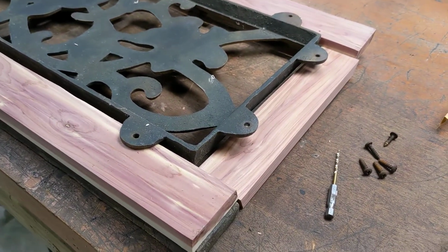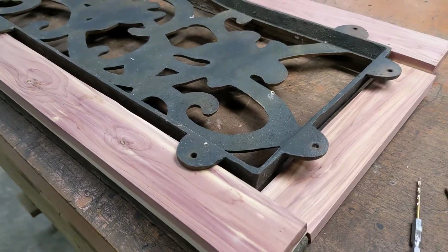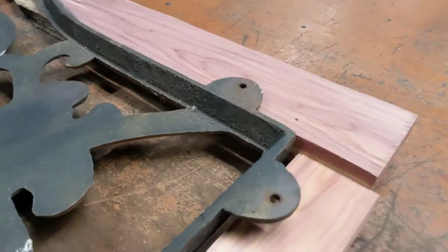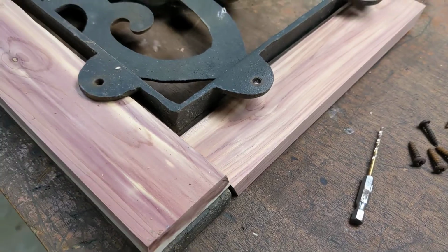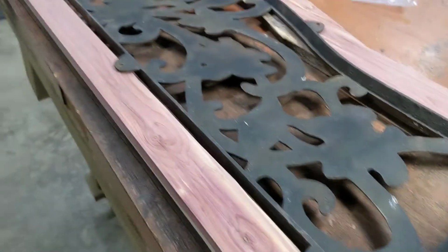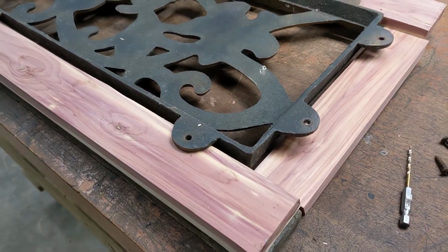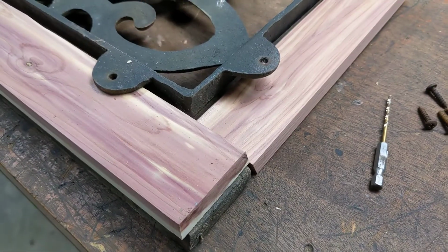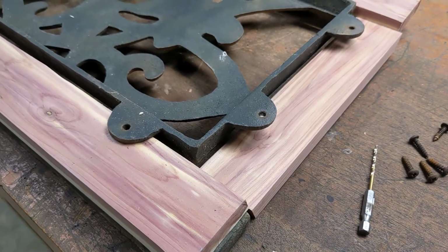The Shopsmith will do horizontal drilling, so I'm thinking I'm going to get everything screwed to the cast iron, lined up as best I can. I know it's going to be a bugger to get these joints to look right. I think they might have to get the old glue and sawdust shoved in trick. Anyhow, get everything screwed onto the cast iron is what I'm thinking. Then carefully mark exact alignment.